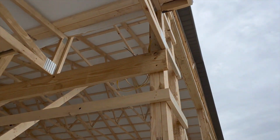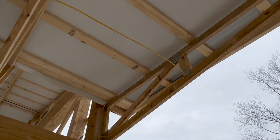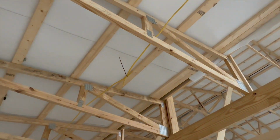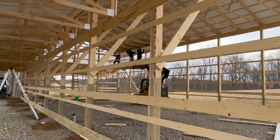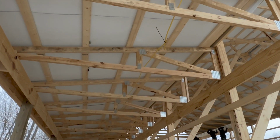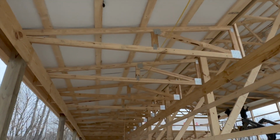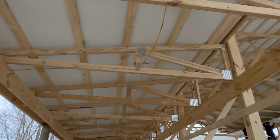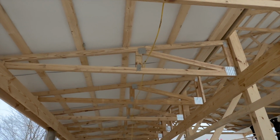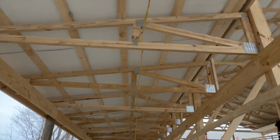Alright, so basically what we're doing is coming into the porch here. We're going to pop it that way in the middle. First can light's going to be at 5 feet, which will be a door right here. So we'll have a can light there, 5 feet. Then we're going to go 9 foot, 1 inch, roughly. That's actually 9 feet, 1 inch, and 3/4. But yeah, that's where another one will go, where that zip tie is.